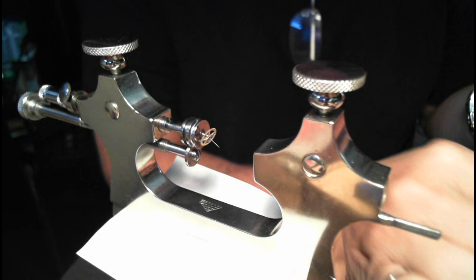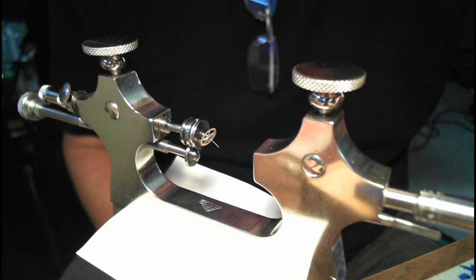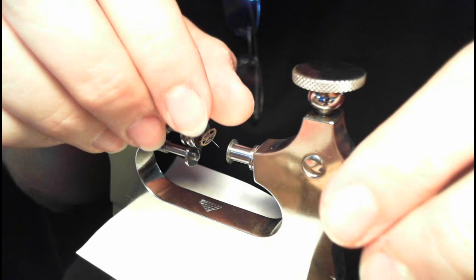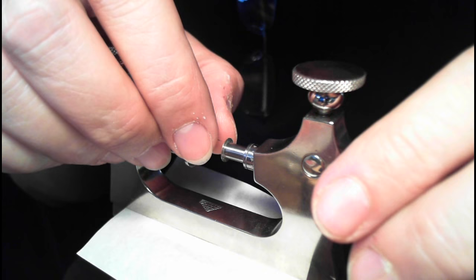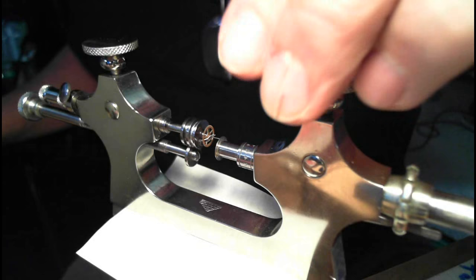And you have to pick the right size pivot hole. And again, I think this was something like 15, but I'll pick 14 and see if this fits. So put that 14 in there, right? And then that will align with this quite nicely, I believe. And then I will stick that in like that. I'm just hoping the pivot fits through. And look at that, it does. And I am going to lock this down, and I'm going to zoom in so you can see it.